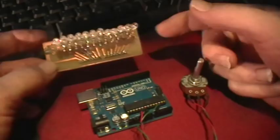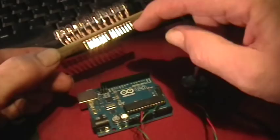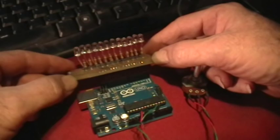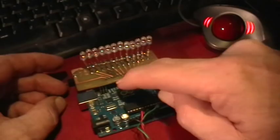And just for convenience sake, what I've got here is a printed circuit board that matches 12 LEDs with their dropping resistors to some header pins that I can plug in directly to the Arduino right there, if I get it into the right pins. Okay, so now I have an LED plugged into each of 12 of the digital input-output pins of the Arduino,